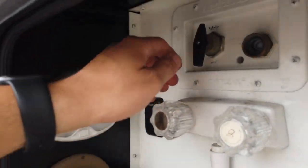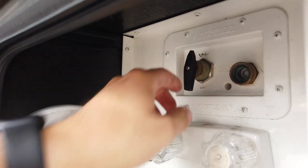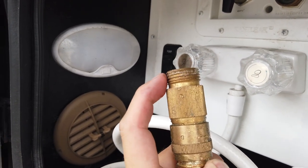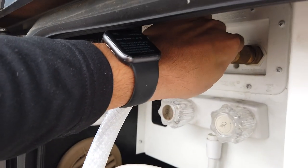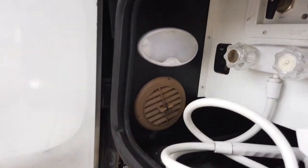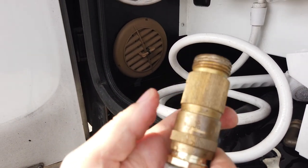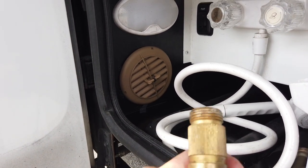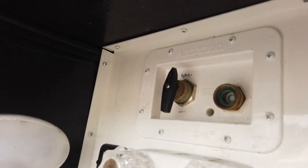This component here is a pressure regulator. I always try to bring plumber's thread tape — I wrap the threads a little bit before fastening it to the RV. Always leave your pressure regulator on your hose to keep pressure buildup from damaging the pipes inside the RV. Always leave this gold piece on. When you connect the water, also use plumber's tape to wrap this so you don't have any leaks, because garden hose-type hookups are notorious for leaking.